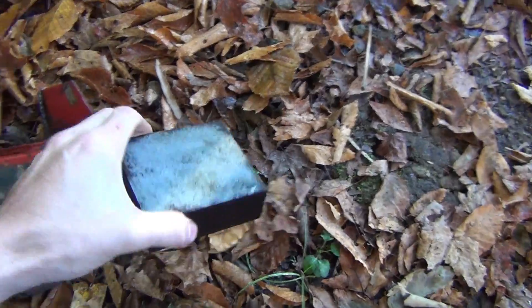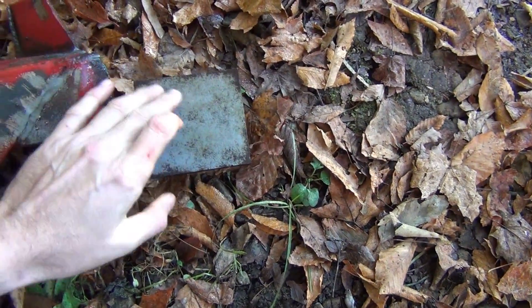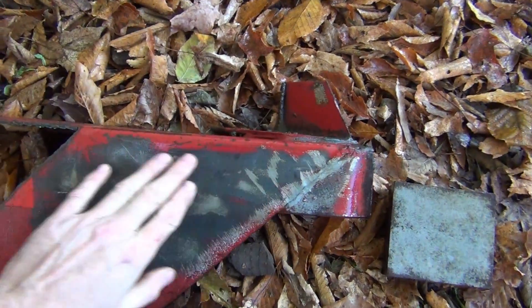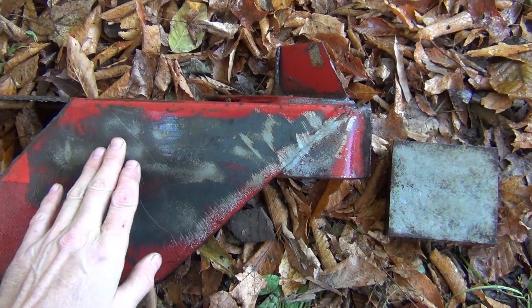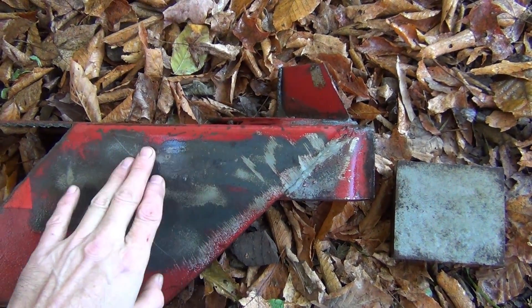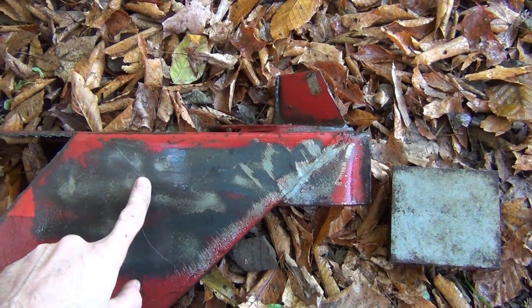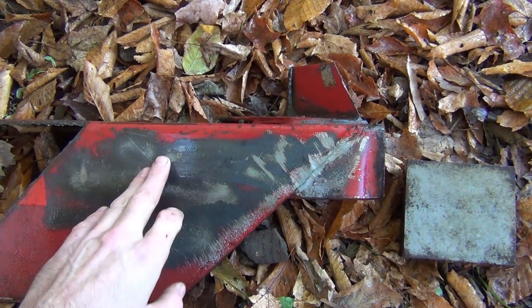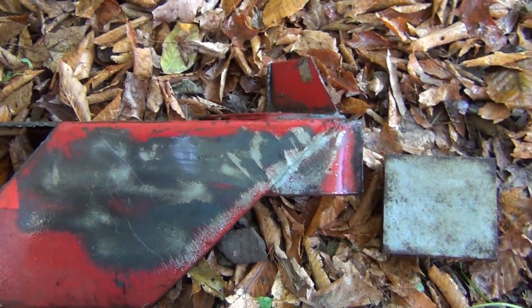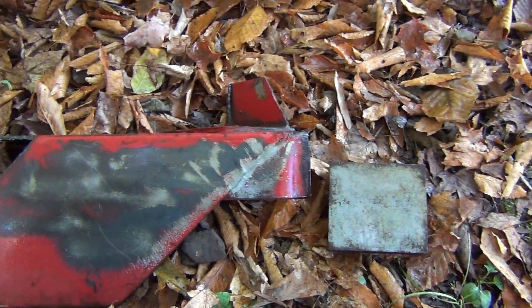You can see how that turned out. Like I said, that was really heavily scaled after 18 years of sitting out — there's still pitting, but the pitting was the result of corrosion. Most of it is real smooth now. Here's the brush hog part — it took all that paint off. I noticed it didn't take off some of the mill scale, which is a real hard coating that forms when they hot roll steel. That sometimes has to do with the abrasive itself — if you use a harder abrasive it strips that off faster. But it stripped the welds off everything; you can see the original sloppy fabrication work.